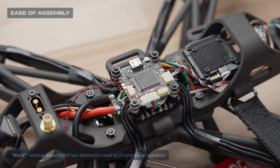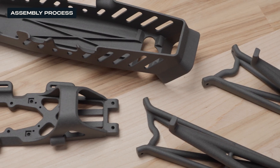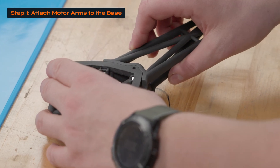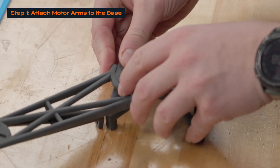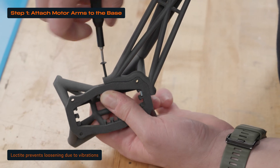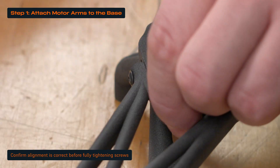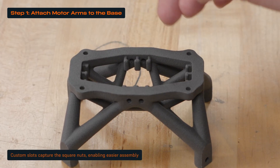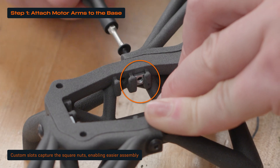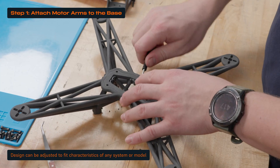Now let's walk through the assembly process for our custom SLS 3D printed drone and explore best practices for integrating additive manufactured components with off-the-shelf hardware. Almost every drone build, whether mass-produced FPV or customized, starts by connecting the motor arms to the base so that you can attach your stack. Dip your M3 screws in a tiny bit of Loctite rather than applying Loctite to the thread directly. Leave your screws slightly loose whilst you ensure alignment is correct, then go back through and tighten them all down. The drone base has slots that capture the square nuts, so you can secure the arms without holding the nuts in place whilst you screw it together. The drone design is also fully parametric, so if you change one feature's size or shape, the rest of the drone will change accordingly.